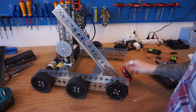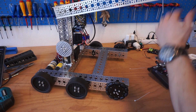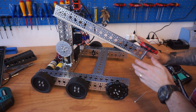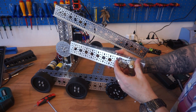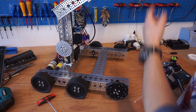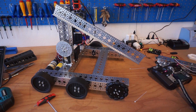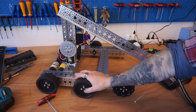Other improvements to consider: because this is just a simple two-bar lift, as I lift it up, my endpoint is not parallel with my original point. So in its current state, I'd need to add an additional servo to the arm implement to keep it parallel to the ground. If I were to mount a quick arm to this, the problem with this two-bar design is the arm does not move parallel to the floor. You could use a basic four-bar lift to keep it parallel if you want. I hope you found that helpful as a basic two-bar lift — best of luck lifting things up with your robot.